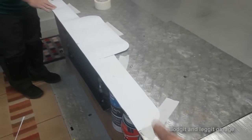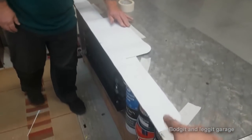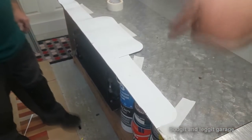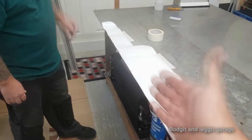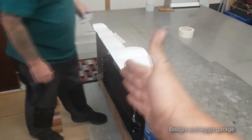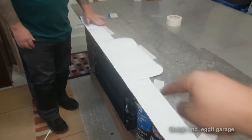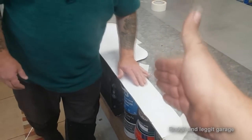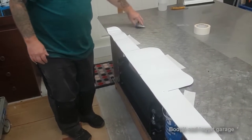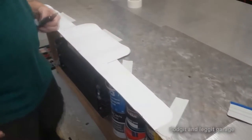The reason why I've done it this way is because he has the stickers, and it just makes my life easier because this is essentially a big sticker that's made for signs. Now we've got the shape and we're going to peel this off and stick it to our checker plate, and then I'll come along with my angle grinder and actually cut it off rather than trying to draw a line. With it being a sticker, it's just physically a lot easier to do it — otherwise I would just be drawing a line.